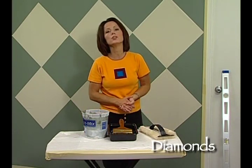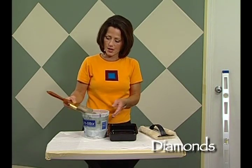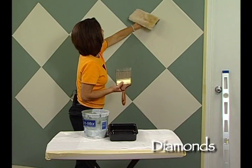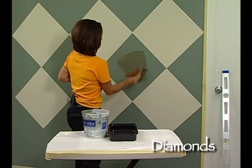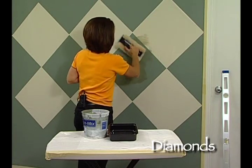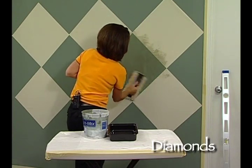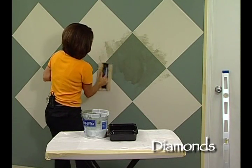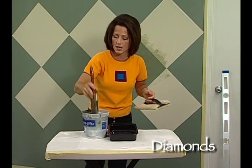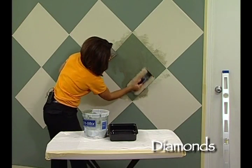In this particular situation, we're just going to do a standard glazing using a contrasting color from the wall. I dip my paintbrush into my glaze and I'm going to put it on the portion of the wall that's showing the base coat color. I'm going to take the woolly and just jab through it, working with the direction of the contact paper because you don't want to push against it and allow the glaze or paint to seep under — it's a very low adhesion contact paper.